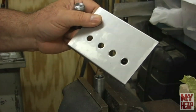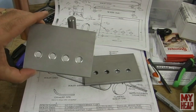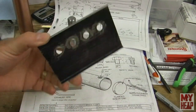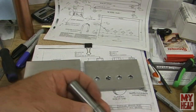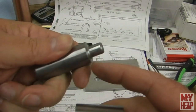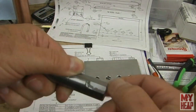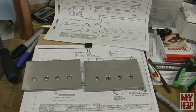I'm going to do the rest of them off camera and come back in a couple of minutes. Both firebox sides now have dished holes — looks a lot better. These need to be cleaned; there's layout die and sharpie marks on the inside. The tool actually worked pretty good. I did have to grind a radius cutter to make it. It did slip in the vise and put a couple of burrs on there that I'll need to knock off. That was a handy tool and a good technique to know.